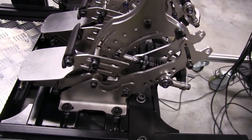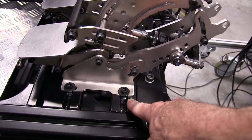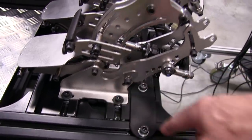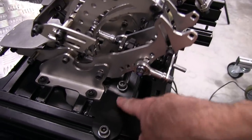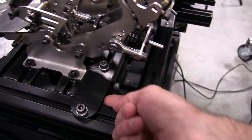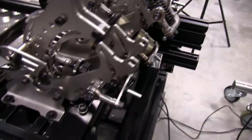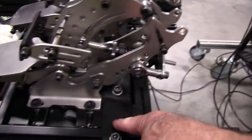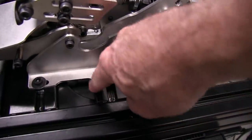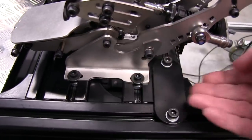But if you need to mount these as solidly as you can, I put two 4080s in here to get my channel spacing right, so obviously we're fitting the mounting plate flange here. And I put a reinforcing piece on the back of the 4080 on both sides. This is about a 7 mil thick plate, and I have one on the other side too. Very solid, because typically how I'll mount this is I'll have a corner bracket here, and a corner bracket on the other side of the 40 series. This one's gone, this one's still here, as you can see on both sides. Because of the spacing, I had to lose that.